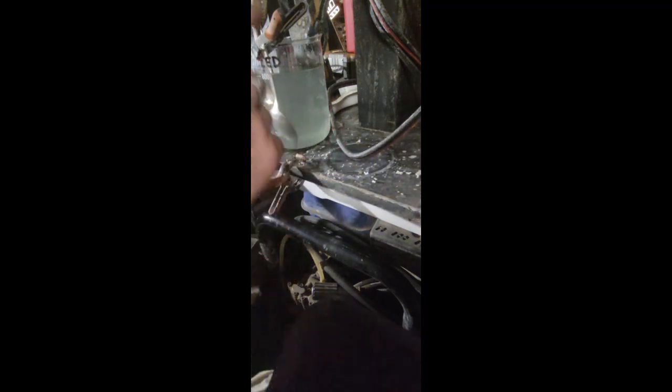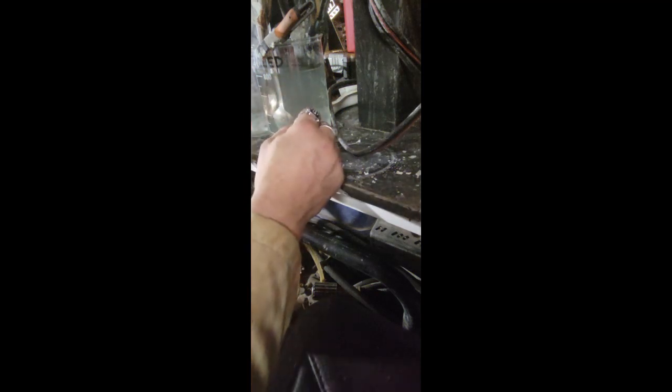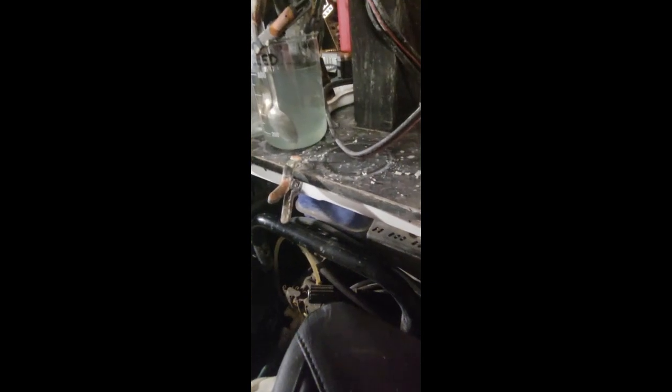All right, so positive alligator clip secure to your silver, whether it's forks, spoons, knives, grandma's old tea set, what have you. Once you have this set up, we have 800 milliliters of distilled, preferably, or tap water, mixed in with 100 milliliters or 40 grams of your choice of nitrate, potassium, ammonium, or sodium. We're going to put the cathode on a hunk of copper. It just has to be a clean hunk of copper, no big deal. Your positive charge connects to your plated silver. Now, you're set up, you're ready to go.